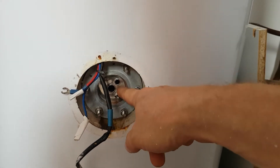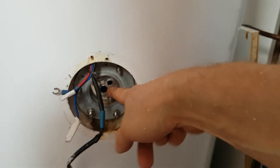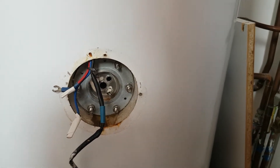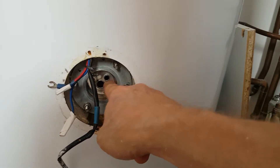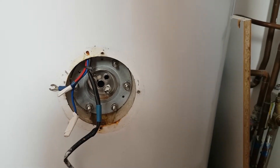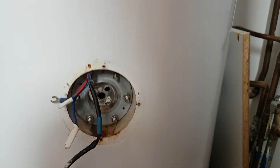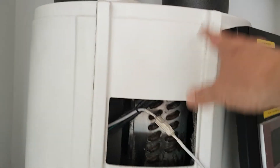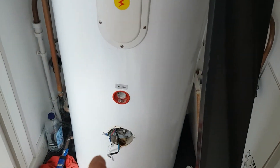These elements are complete rubbish - totally unsuited. The stainless part of the element goes porous, and I think there are lots of inclusions in the stainless when it's extruded. If you look at it under a microscope, you can see the surface is kind of porous, and they just break down and start leaking to the earth connection or the outer case within six months to a year, and then it won't run. It's the ESP EcoConnect heat recovery hot water tank - good in principle, the refrigeration engineering seems to be reliable, five years old without any trouble at all apart from blowing the dust out, because there's no filters on the input. But the immersion heater is a complete pain.